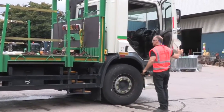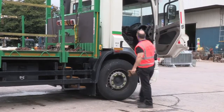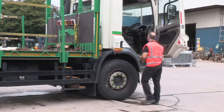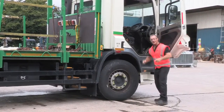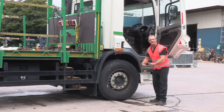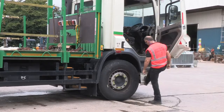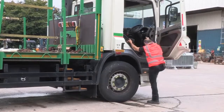You know, some things we just take for granted, and it is handling our own body weight. Access and egress, well, we know this is 3 points of contact by now, but one of them is not the steering wheel, it moves. Just be mindful of conditions, remember, assessing the environment. You can take the slip hazard with you, stand on there, that slips away and you crack your shin wide open. 1, 2, 3.